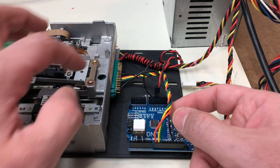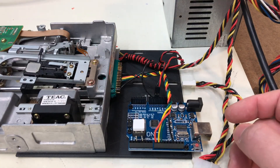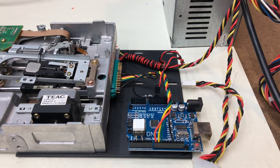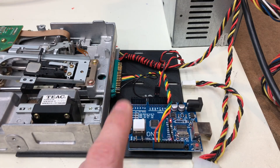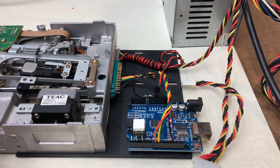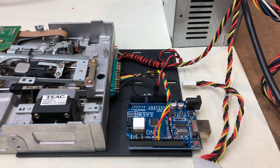Basically you've got the Arduino connected here. This is an interrupt pin — you press it and it runs the cycle. It's got a couple power pins coming off this AT power supply, grounded together, and the floppy drive is plugged in. We turn on the big master clicky switch and when I press this button it'll run a cycle. You can't see it spinning the disk because the drive's not closed, but it does the cycle in and out. That's basically the entire solution — pretty super straightforward.